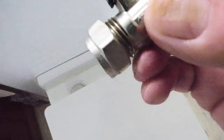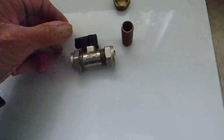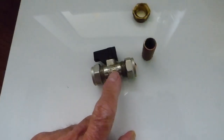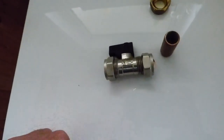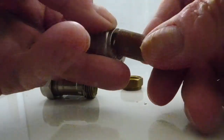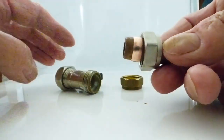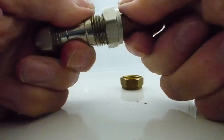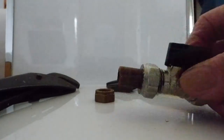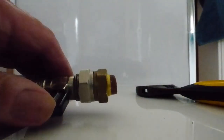I'm going to fit this little isolation valve and it's going to go in here. I'm going to do that because it's nice and flexible - I should be able to squeeze this in there quite easily. Now make sure that your valve arrow is the right way around, you don't want to get it wrong. I'm going to make this bit up with this bit of copper in the end there already, so it's ready to go in and just put the flexi straight on this end. There's a fitting - put that on there - and an olive on there. Fit it in at the outlet end and do it up.